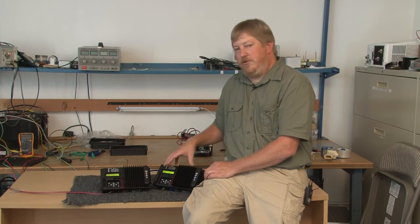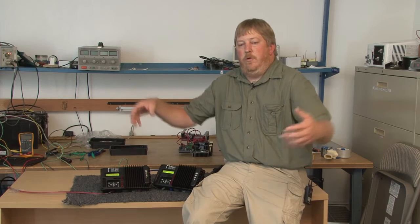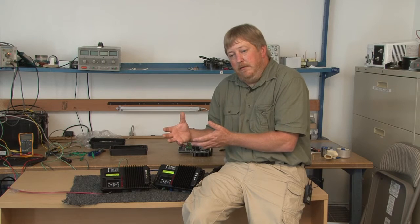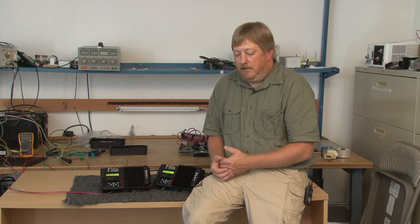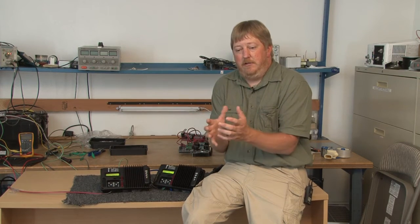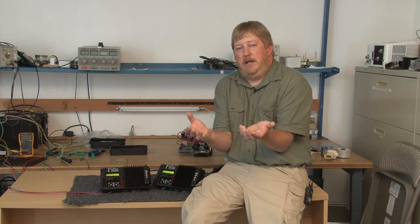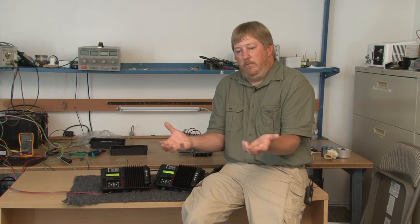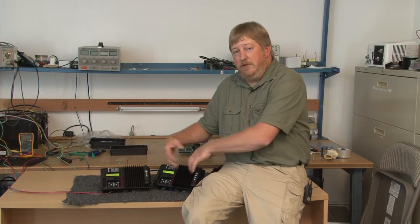Sync mode, on the other hand, allows us to keep an individual array connected to each controller and put a bunch of KIDs together in sync mode to coordinate charging into a single battery. Each KID would then have its own solar array. The benefit is that if one module is doing 8 amps and another is doing 9 amps, in a combined string everybody comes down to 8 amps. In sync mode they each operate independently, so you don't lose that extra power.